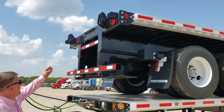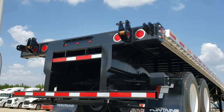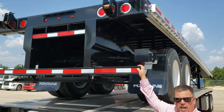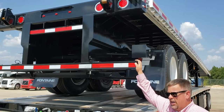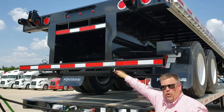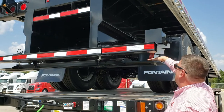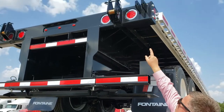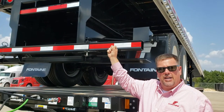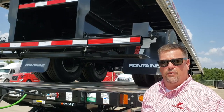You can get an idea of the back of the mount here. This fits the majority of all forklifts — a piggyback mount — up to 80% of them. There's a couple it will not fit; we've got a different setup for those, but it's not in production quite yet. You can pull this pin out here, and you'll notice that the bumper will fold into pieces. Your wheels will sit up on this pad, and you adjust it. Then you have your hooks up here and your chain pins on both sides. You also have a cable hookup to connect the lights onto the back of your mount — plug in — that way you're safe and have functioning lights on the rear of the forklift.